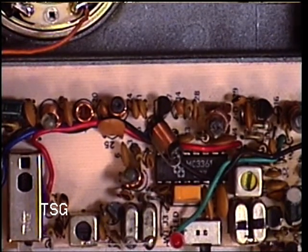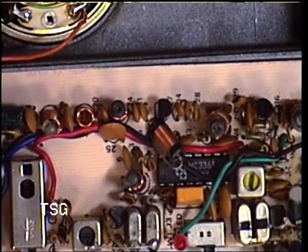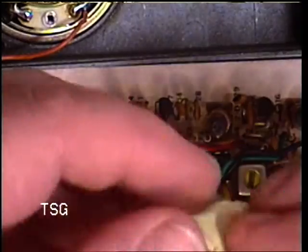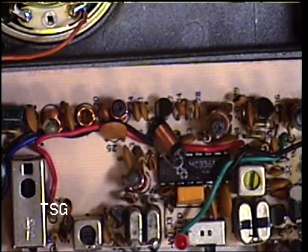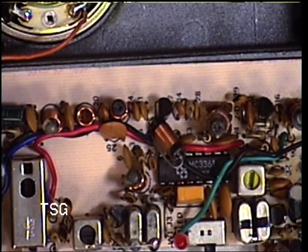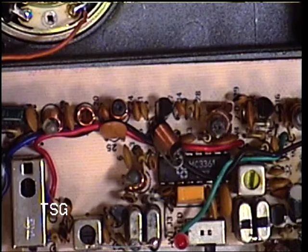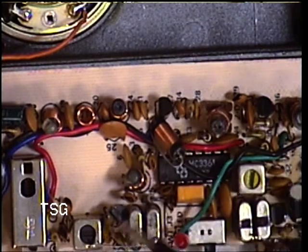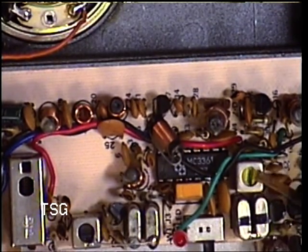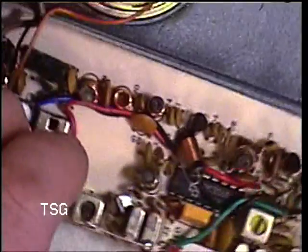To be honest, the internals aren't that horrible, but the way the panel is constructed is atrocious. I presume that bit of tape protects something. And of course it's crystal controlled. So obviously these components make up the transmitter, that's going to be the antenna matching coil, that's going to be the receiver, that's the detector part of the receiver, and that's about the only adjustment on the actual receiver.